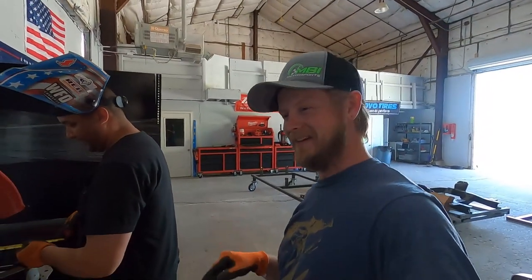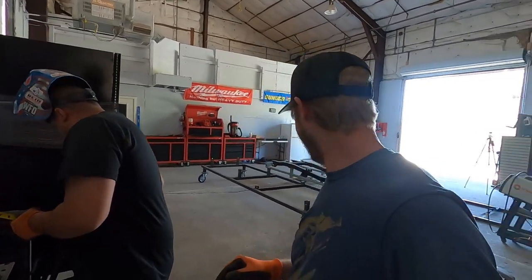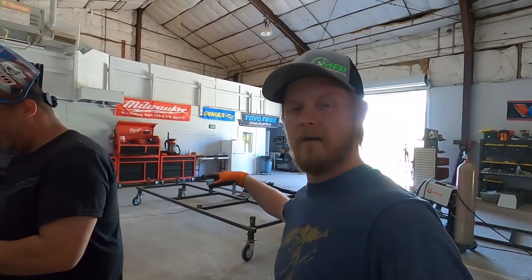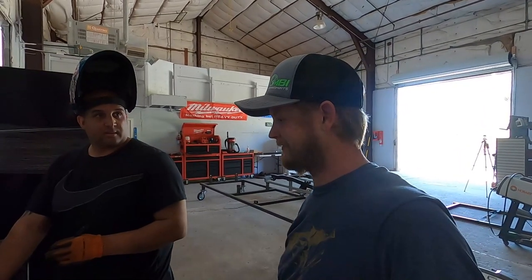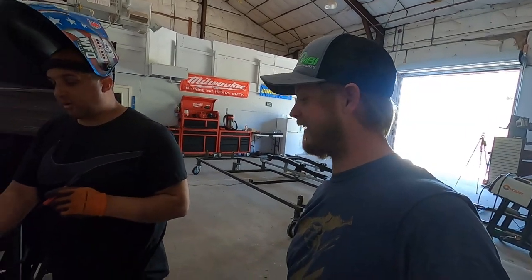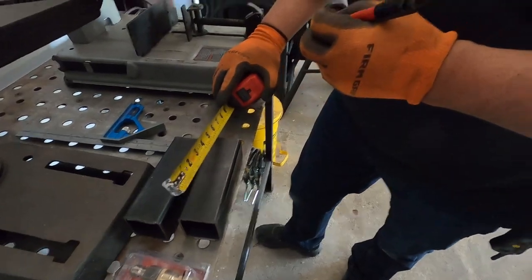So, the reason he's doing this is because he changed the measurements. I'm usually the measurement guy. When he called in the order to go pick up the steel and have everything cut, we decided to make all of them about 4 inches higher than they were before. That way the forklift won't interfere with the rocker when we're trying to pick it up. We're still going to have an issue with the forklift because we're cutting it. No, because the rest of them are higher. This one you just need way higher. Correct. So, it's 6 instead of 3.5.